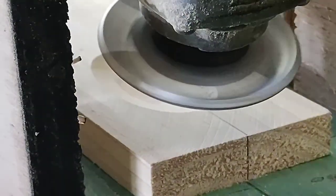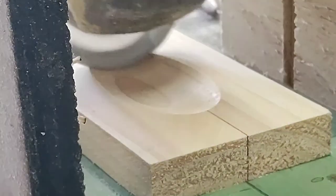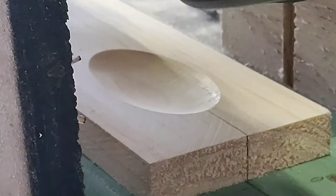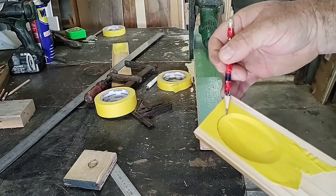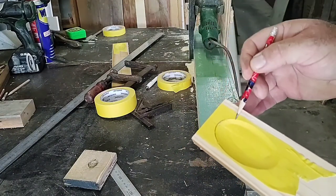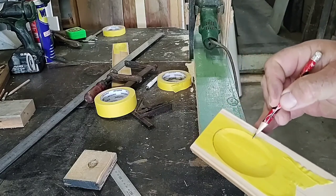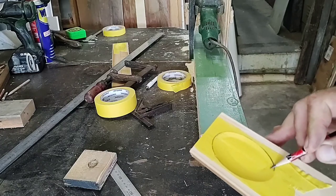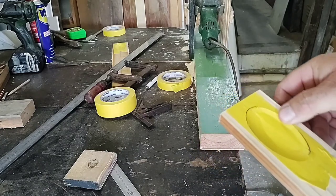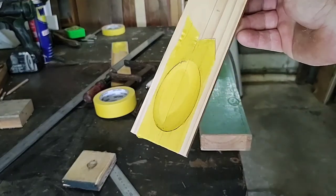All the time as I cut I lower until I get to the desired depth. Once I've cut the bowl, I put some yellow masking tape over the hole, press it down, and run my finger along the edge to crease it. Then I run a pencil around it, which highlights where the bowl is. This aids in cutting around the bowl equally and sanding the bowl equally.